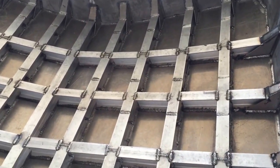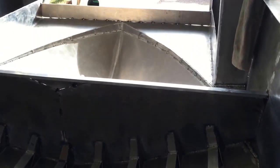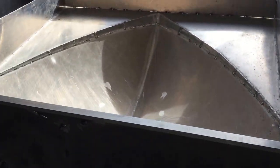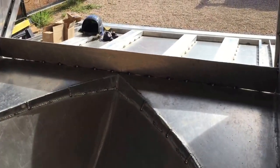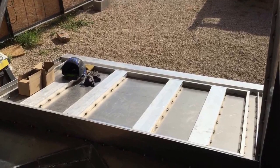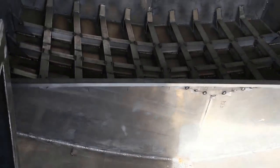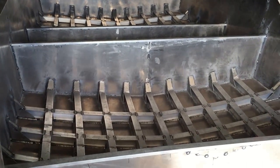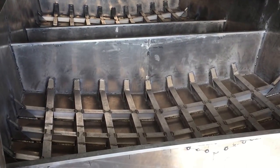So there'll be no bilge pump in the fuel area. In the other four spaces, there can be a bilge pump with an automatic float — that works out well. It's a tough decision figuring out flotation on a boat like this. The front deck area is basically 11 feet wide by 14 feet long and will be completely welded with eighth-inch plate for the floor, with scuppers cut into the side.